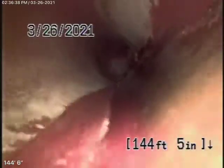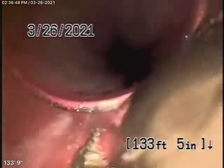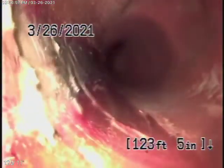So we've got clay pipe outside, there's the city connection. The clay pipe looks pretty good — this is the six inch clay pipe coming back from the middle of the street towards the property. It's nice and clean, good condition. The thing with clay pipe is it doesn't rust, but cast iron will rust. This is all clean — nice and clean, good condition outside.